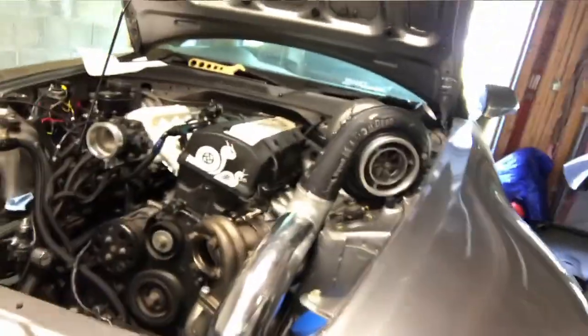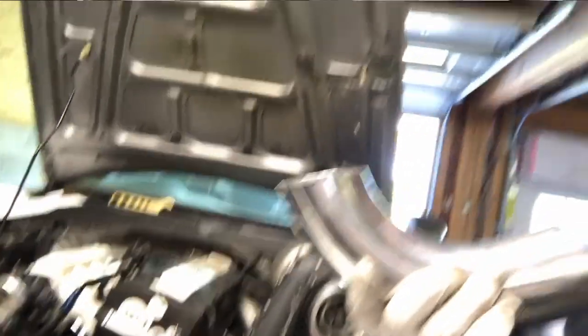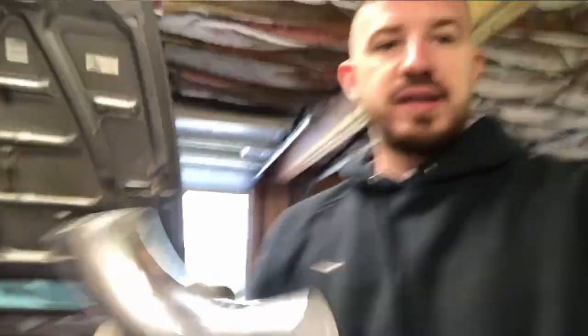As you can see it kind of comes at an angle - it's not perfectly down - so I had to cut a little bit of an angle on this 3 inch piece so that it'll bring it out and match down here, squared out. I got that cut finally where I want it. I've just been tacking it together. I don't do the finished welding on aluminum especially - I feel like I could do some on the stainless, I'm a little more comfortable with that, but the aluminum is kind of a different ball game. I've even just been getting decent at tacking it together because it's very different than stainless.